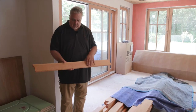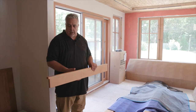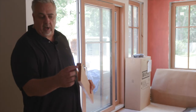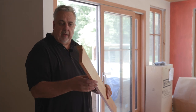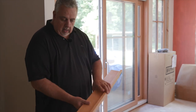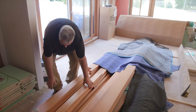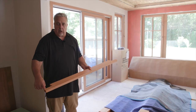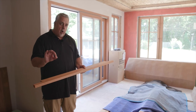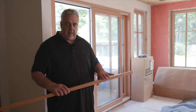Each of these gets made tied to a window on the window schedule. This is our head casing — it's a standard one-by with a one-by cap. You can see we have that little bit of a reveal going around there. These are all pre-applied and connected at the shop and shipped out here. We have the accompanying sill that goes to that window; the horns are already cut out, so not quite plug and play, but the heavy lifting is done.